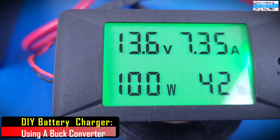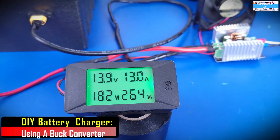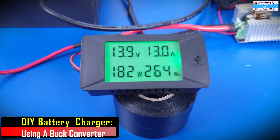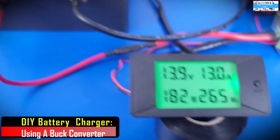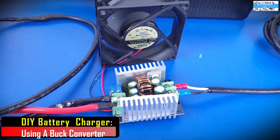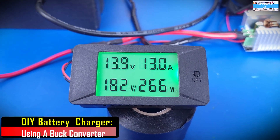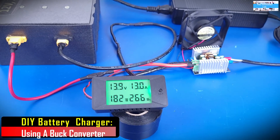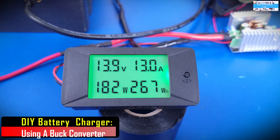It's charging and quite impressive. Right now our charging battery voltage is about 13.6 volts, charging current of 7.35 amps, and we're putting in about 100 watts into the battery. An observation I made while using this DC buck converter: if you're going to exceed about 10 to 11 amps — as you can see here, right now we are charging at 13 amps putting in about 182 watts — you'll want to use a fan to cool the DC to DC buck converter. If it gets hot, your current setting will crash down to about one amp. With the fan connected, the whole system was very stable at 13, 11, or 10 amps with no issues at all.